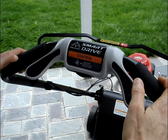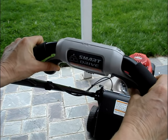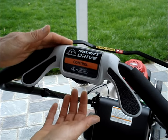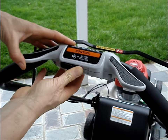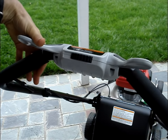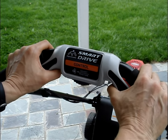There are complaints that your thumbs get tired from pushing on the smart drive, which controls the speed of the mower. My control came from the factory in this position, and I think people don't realize you can adjust it — push this button over and you can position it higher. If it's positioned higher, you can grasp and hold it with the palms of your hands.